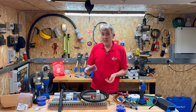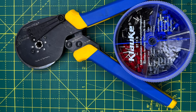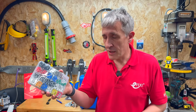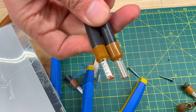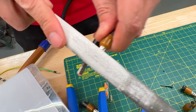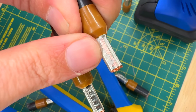Without standards, you end up on an online sales platform where a set of ferrules can have a hidden problem. When buying ferrules, they all look pretty much the same — but buy from a trusted supplier. I bought a competitively priced kit from a well-known online retailer, and at face value they look almost identical to our trusted supplier's ferrules. However, if you take a file to them, ferrules should be tin-plated copper, and as I file away, you can see the copper underneath the tinned surface.